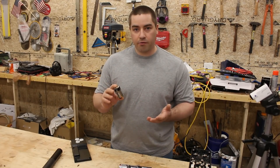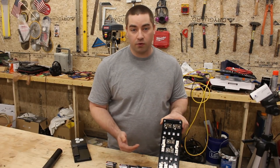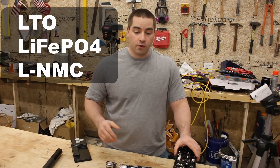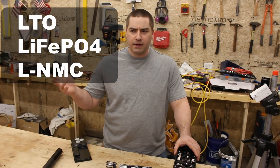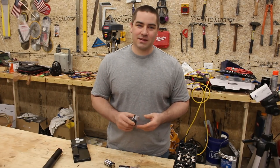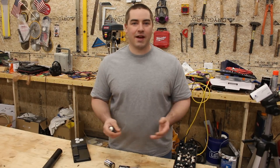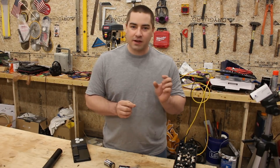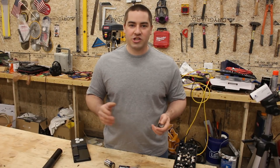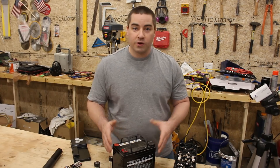But every battery is going to have a range. These LTO cells, for example, have a range between 1.5V and 2.7V for each cell. So how many in series do we need to create 48V? Same with lithium iron phosphate or the Chevy Volt battery, which is lithium nickel manganese cobalt. I'll be making some general statements about batteries, about their nominal voltages and their charging voltages. There are exceptions to every rule, and one brand is going to have its own specific requirement. It's up to you to look up the manufacturer's data sheets.